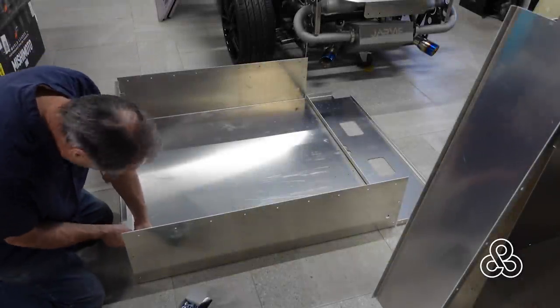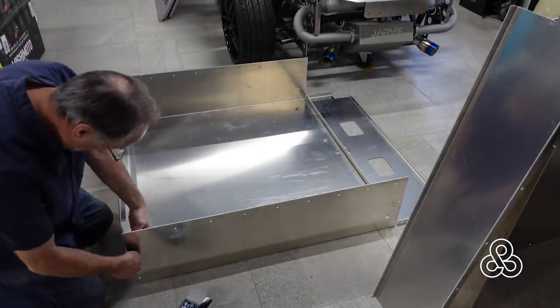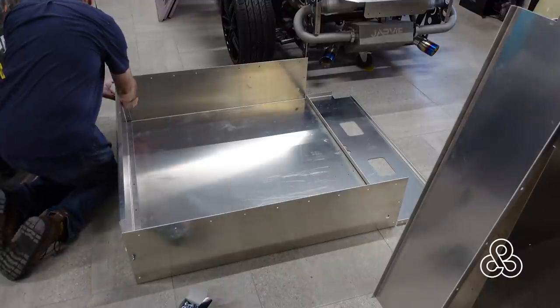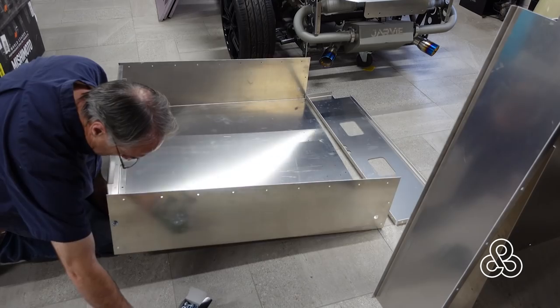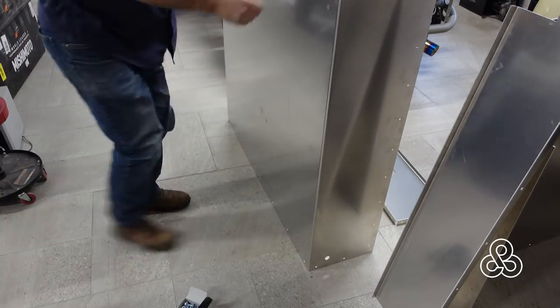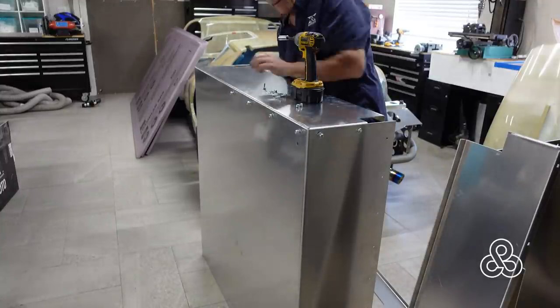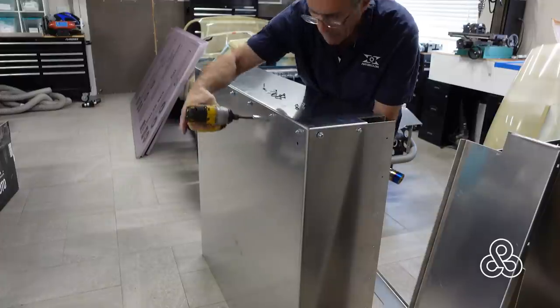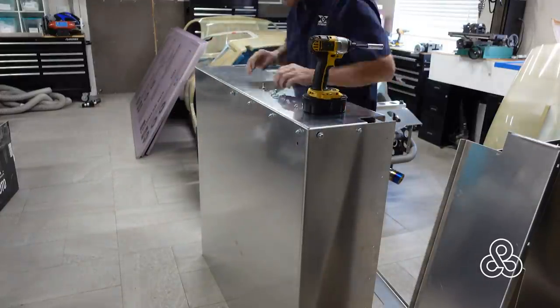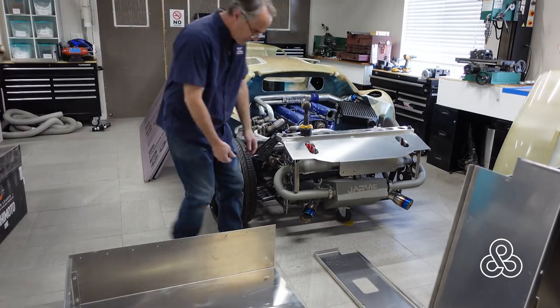The water storage for Leviathan is all going to take place underneath the subframe. Like in most motorhomes and RVs, a lot of these tanks are kept under seating, under beds, things like that inside the cabin. We have a problem with panels that are going to be part of the foldout system and will occupy a lot of that space, so we're going to hook all these tanks underneath the subframe between the two main rails.